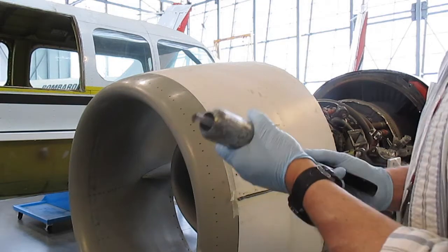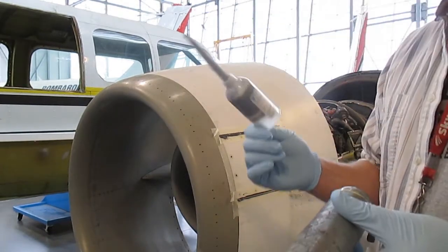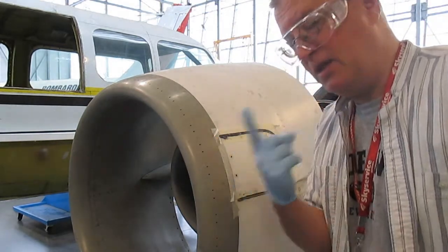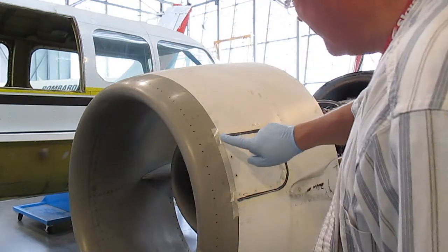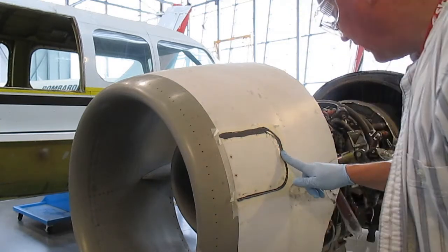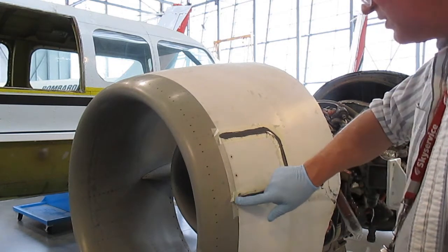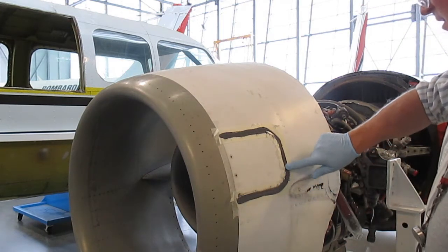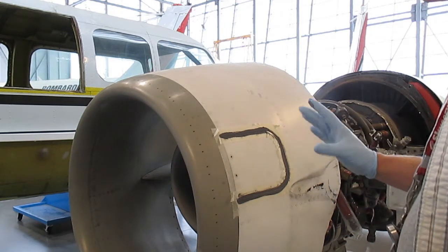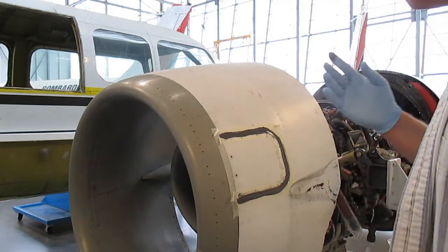Now I'm good — take the pressure off, I'm done with this section. Get rid of the gun and immediately deal with the material. Now what I'm going to do is use a wet finger and go over the whole thing like this. What that's going to do is push everything to a nice flat finished surface. I'll come back here just a little bit and go like that — now I've got a really nice flat, evened out, filled surface with no gaps.